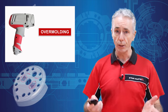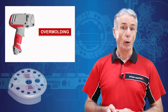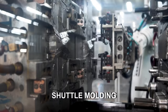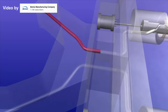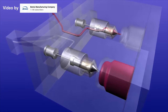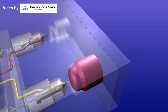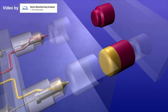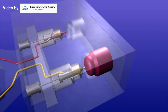Three halves, I hear you say? You heard that right — and as you may have guessed, I didn't do too well in mathematics at school. The two main types of automatic overmolding process are shuttle molding and carousel molding, and both require three halves. The first two halves are the core and cavity that mold the substrate, which remains on the core side. This half is then shuttled or rotated to meet a secondary cavity, the mold closes, and the overmolding material is injected into the gap. With very low quantity molding, we'll often just hand-transfer the substrate into a second mold for overmolding.